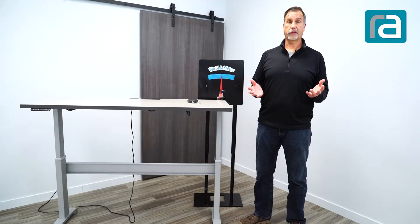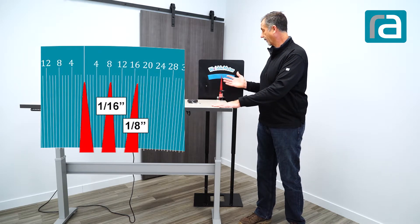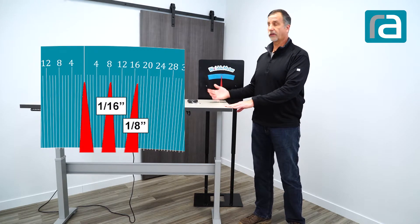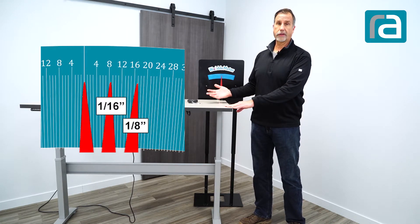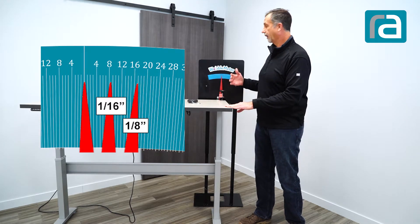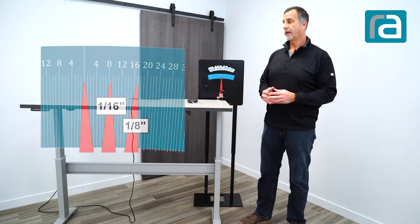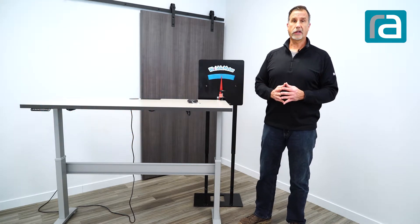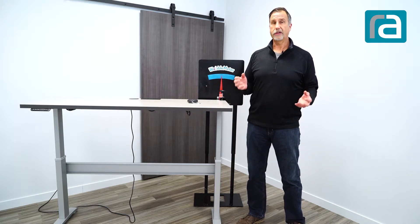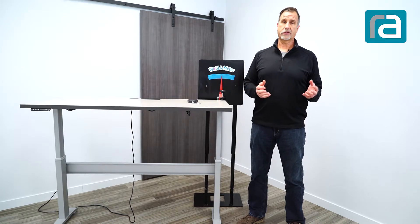So what do the numbers really mean? If you're pushing on the table and you're getting a deflection of around an 8, that's about a 16th of an inch, and that's one direction in the lateral movement — so you'll have to multiply that by 2. You can get up to maybe a 16 or 17, and then you're going to be up to an 8th of an inch of travel. An 8th of an inch doesn't sound like much, but remember that table in the restaurant when you sat down and felt that movement? It doesn't take much for it to be something that's extremely noticeable.